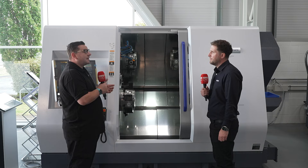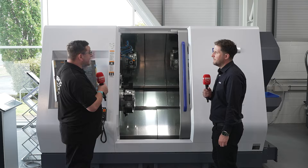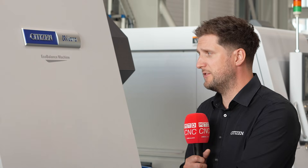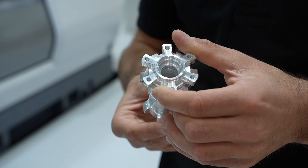That technology is great for preventative maintenance as well as hitting tight tolerances. The machine has a large working envelope — 80mm through the spindle — and the new parts unloader handles parts up to 7 kilos and 150mm long, making it suitable for pretty hefty components.